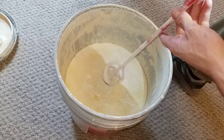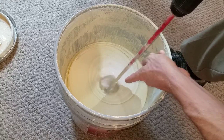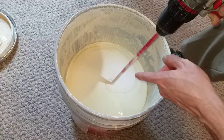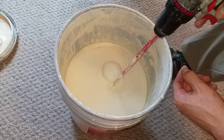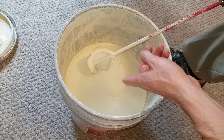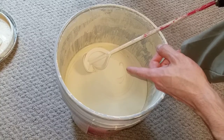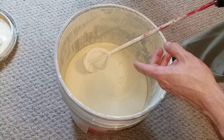I'm going to demonstrate now. As you can see, there's a big hollow area where there's nothing but air. Once you go under, that bubble is still there and it's creating a bunch of tiny bubbles as it's spinning. As soon as I let go, that big bubble is going to race to the surface — like that. But there are actually very small bubbles all entrained in the paint right now. This is very bad because all these bubbles will show up on the wall once they dry. Those bubbles will have a higher amount of the dye used in the paint, and it'll be very obvious because they'll be slightly darker and appear as specks on the wall.